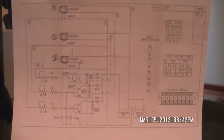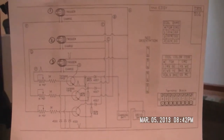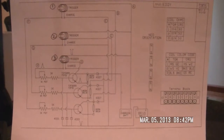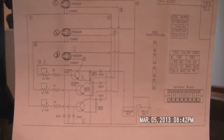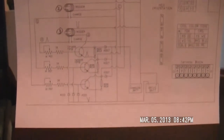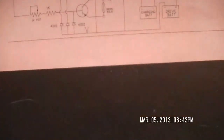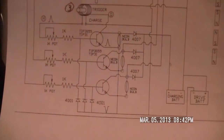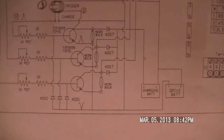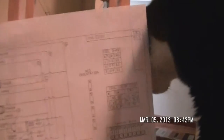I made some assumptions on this circuit, adding three separate 1k trim pots for each of the transistors. And then there are those diodes. I essentially tripled everything in the amplifier portion — or the switching portion, I guess is what it is.